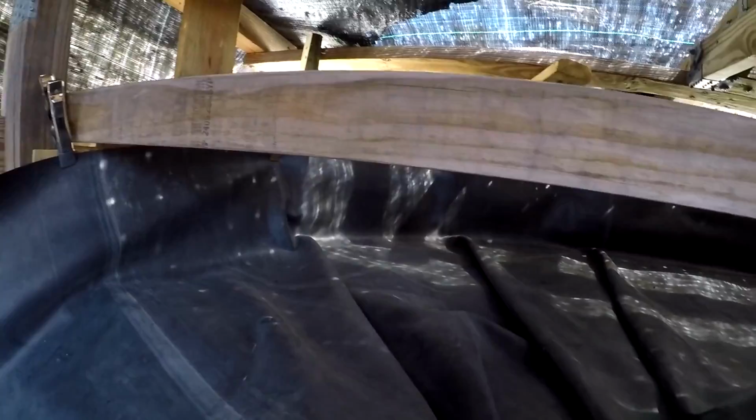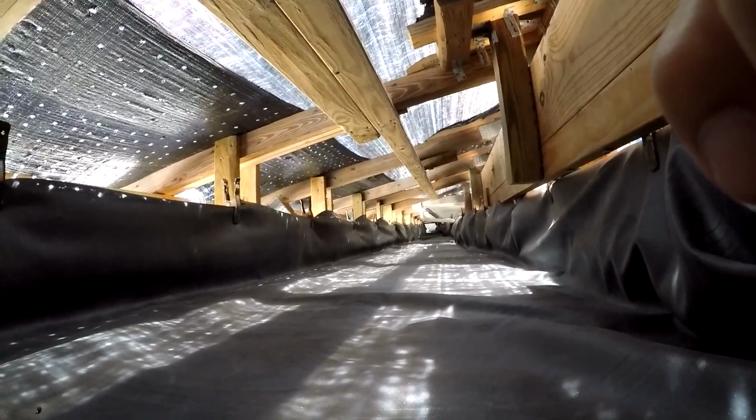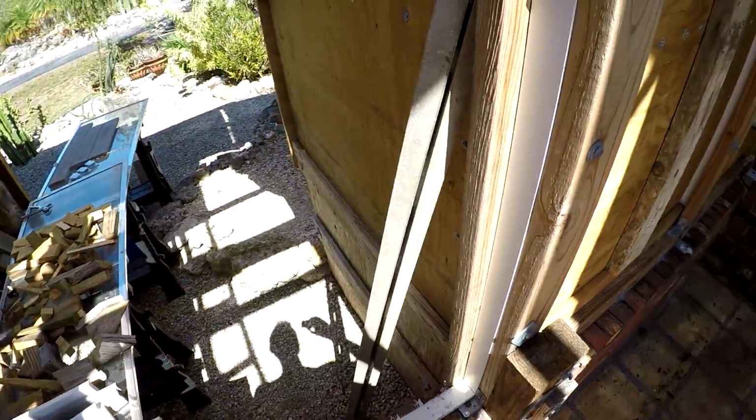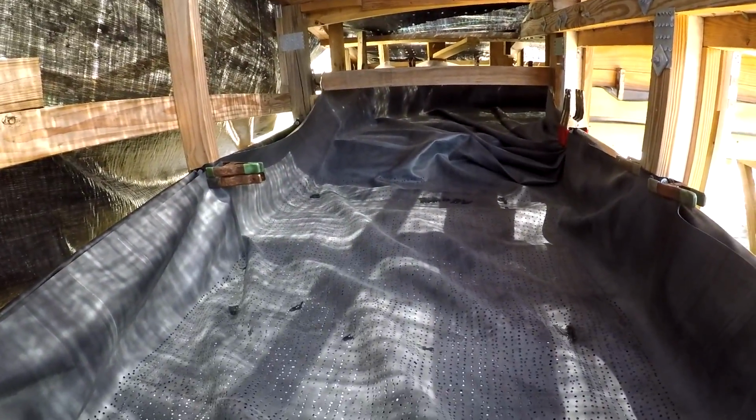This is where it comes into the filter section. From over there, that's about 45 feet long, and it comes over into here. And I made my shower head, so to speak. That took me 2 days and 11,000 holes, 5/32 each. That hopefully should be enough.